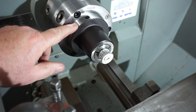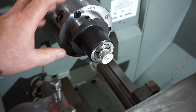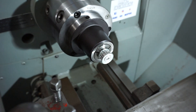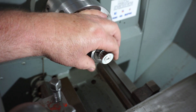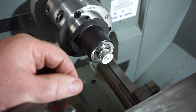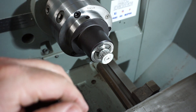I've brought you over to the lathe and I've got the Bison 5C Collet Chuck on, and this is the one that Paul Frink over at Cape Cod CNC donated to the channel and it's a bloody ripper — I'm really, really happy I got it. This is not holding on by much; I've just grasped onto that little end bit there. Now I've spoken to Greg and these aren't high RPM pulleys — it's quite slow. I'm getting about 50 microns, which is 0.05 of a millimetre runout. It's as good as I can get it. I've mucked around with it, tapped it, moved it — that's all I can get.